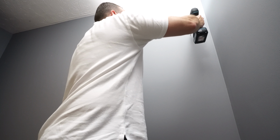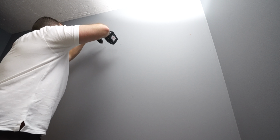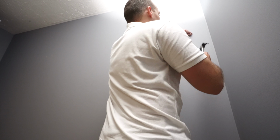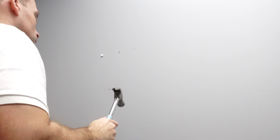I think it's aluminum studs, which are usually behind the plasterboard wall, but I don't want to risk it, so I'm just going to go gently on the middle. If I feel something hard, some resistance to the drill, I'm just going to stop, not go all the way in. All the other holes are fine, just the 2 holes in the middle are a bit funny, but I'm counting on the plasterboard wall. There are no pipes or electric wires behind it, so I think there is just something behind the wall that is triggering the wall scanner as well.